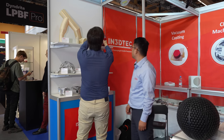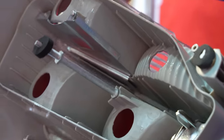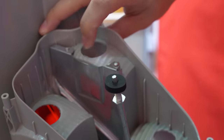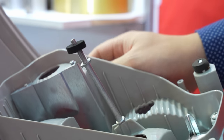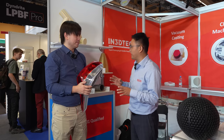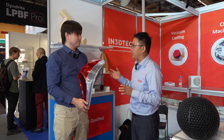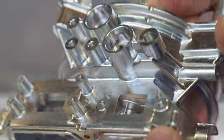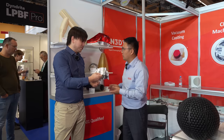We've got a couple more interesting ones here. This is a full car headlight assembly or taillight. I don't think this was 3D printed. For this part, it's by injection molding. And then you've got some sheet metal in here too. So injection molding, the mold is very expensive — it's for large volume production. For prototyping customers, they can do it by 3D printing. We have CNC machining. This one is all aluminum, done with 5-axis machining.